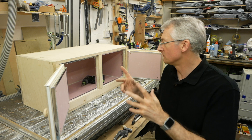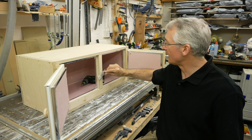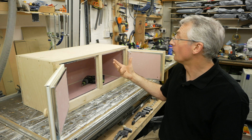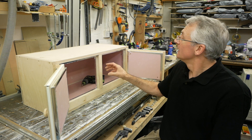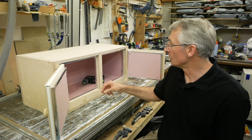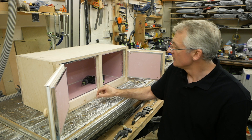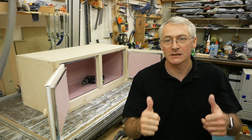I've got a little latch that was just screwed on, and it occurred to me that if there was a fire and this did char appreciably, that latch could fall off and the doors would swing open, which is no good at all. So I'm going to bolt it through with a little stainless steel bolt and a washer, and fix it on with a lock nut on the sides.